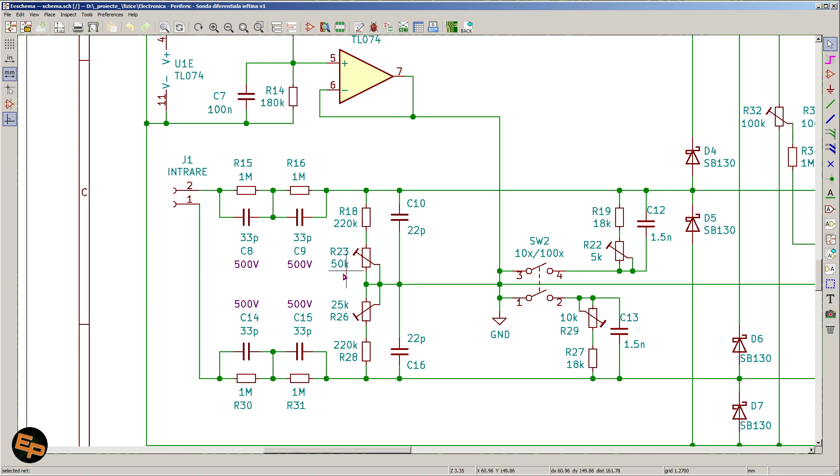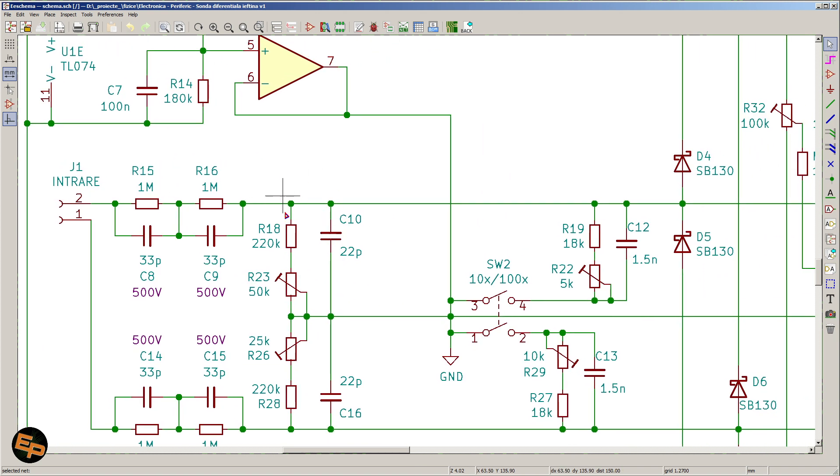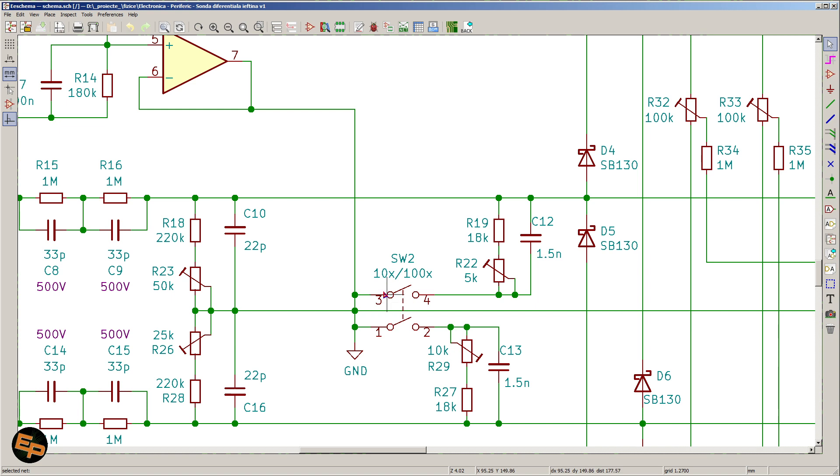I've run tests separately on the positive side and on the negative side, because it's essentially impossible to test both at the same time. I've run a frequency response analysis — essentially a Bode plot — for the positive side at the 1-to-10 attenuation ratio. We have a pretty good response: minus 20 decibels more or less up until 1 megahertz. Then we have a slight decrease in attenuation — or amplification if you want to call it that — and then a drop in response, which is absolutely normal because I'm using an op-amp officially guaranteed only up to 3 megahertz. This is why I said our differential probe can go up to 1 megahertz, but if you don't care too much about precise measurements and a 5 dB error is acceptable, it can go up to 3 megahertz without a problem.